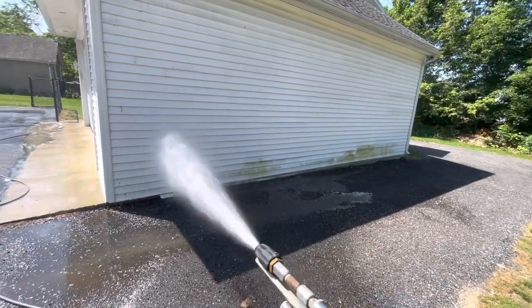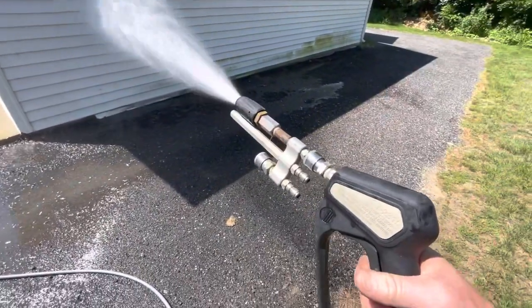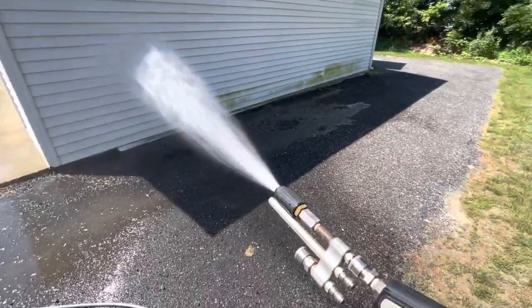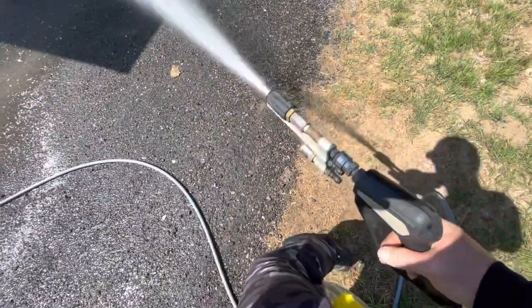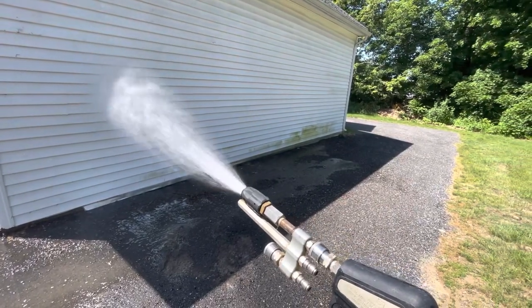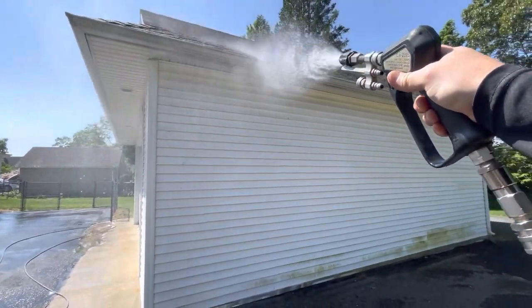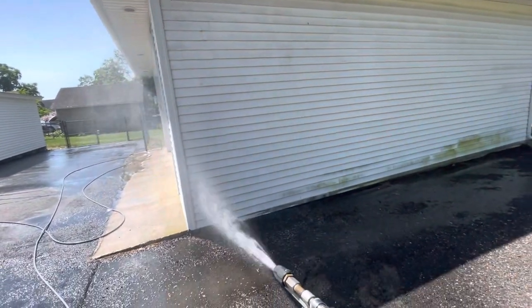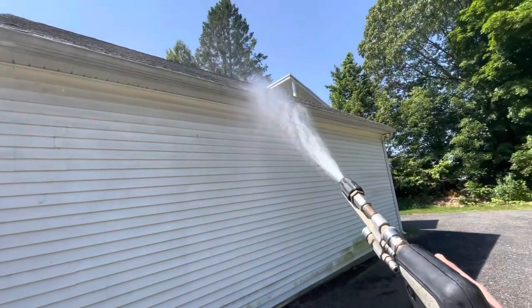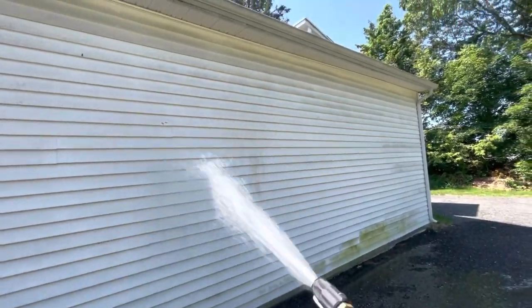You know when something's different, right? You've got to pay attention to all the little nuances - the sounds, the feelings, the change in flow. I've been noticing a change in flow. This is rinse mode, and usually when I hit over to mix mode, it goes through the injector and you get a noticeable drop in GPM. Watch this - see that big difference? I know it's bypassing now. It was doing that less yesterday. I think the DN10 valve was worn out and water was just getting past the valve. Pay attention to the little nuances because it's telling you a story.